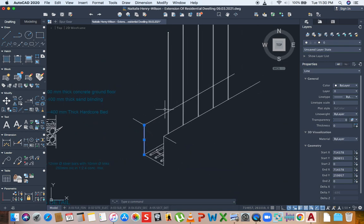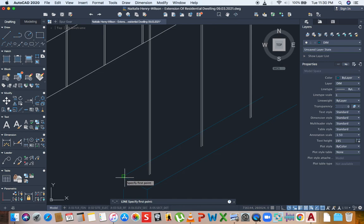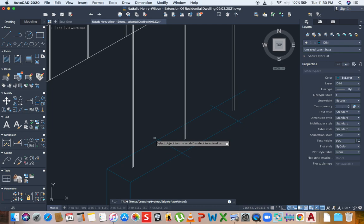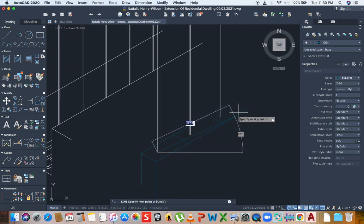All right, so let me see if I can represent the horizontal steel bars. So you have laid the block wall. So you have laid like three, let's say this is the wall, and you have laid it to a certain height beforehand. And let's say that you have the steel bars of one here, one here, one here. This is a block. This is a block. And just imagine the holes in the block, because you should know what concrete blocks are. And before you, let's say this is the third row, you will lay a steel bar horizontally.